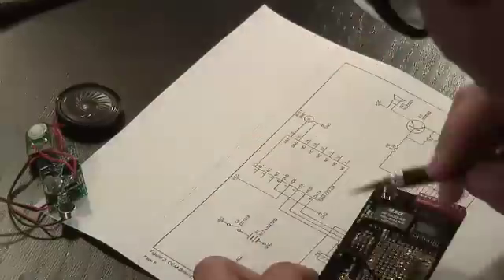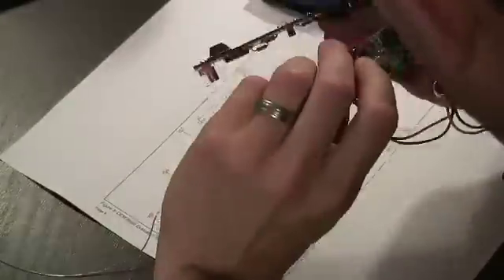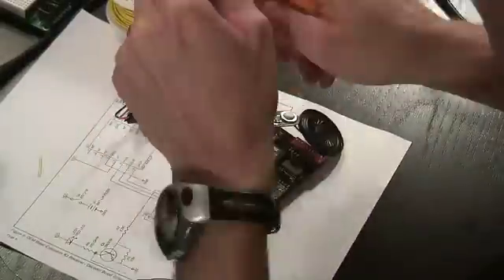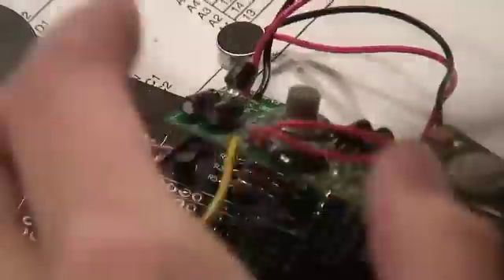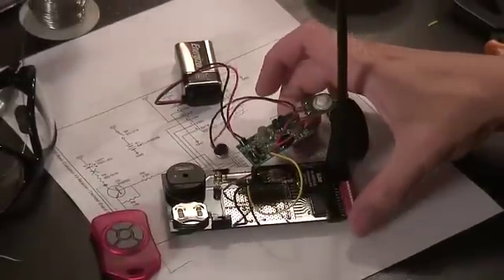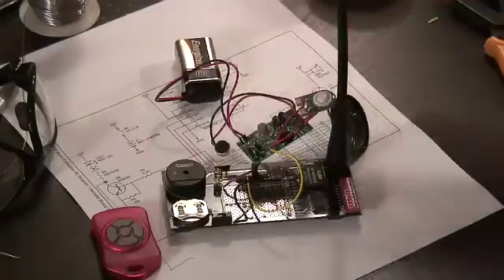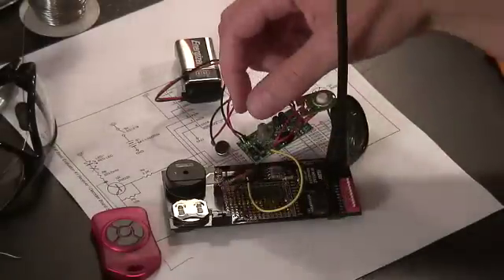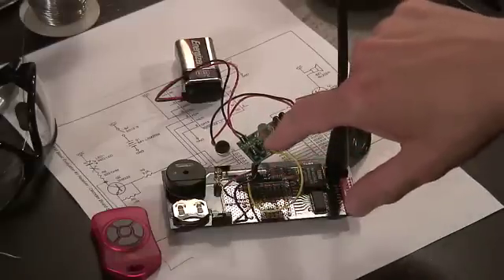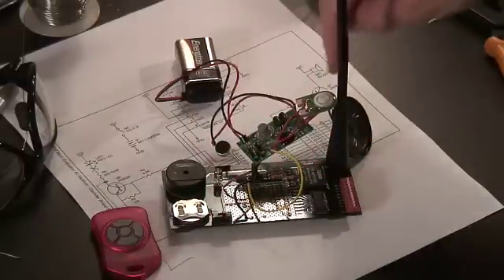That's how this thing works right out of the box. Now let's do something custom — we're going to make the most awesome thing you've ever seen; it's going to blow your mind. What I just did is took the wireless receiver module and integrated it with the digital voice recording module from Radio Shack. You hit a button, you can record some sound, hit another button and it will play back the sound. I hacked together a little interface on the receiver module that will actually emulate a button press, so when the receiver receives a signal from my key fob transmitter, we can remotely play sounds. Everything's set — now we just need to go test it out.